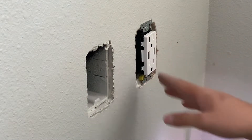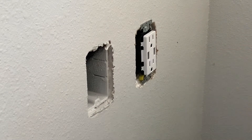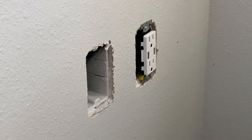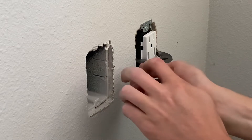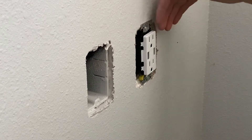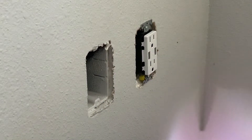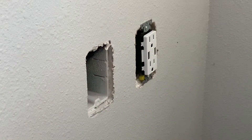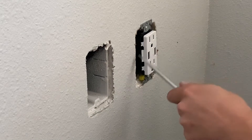You do want to make sure that you plug it straight. It's at an angle right now. One way you can do that is take your screwdriver, put it on the edge of the box, and kind of bend it. Another method I like to use is grabbing my channel locks and grabbing the outside of the plug — not the finished side so you don't damage it. When you put the plate on it, it's not going to be showing, so grab the back side. Then just rotate it the direction it needs to go to be parallel with the wall. It is a little bit easier to make sure it's loose first — once it's already tightened down, there's less wiggle room. Another method is you can stick the screwdriver there and hit it with a hammer. I've just been hitting it with my drill. When you hit it, it pushes it down to make it flat.